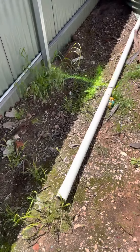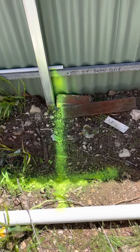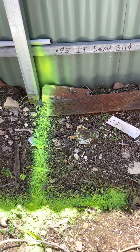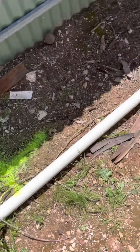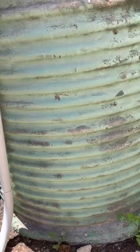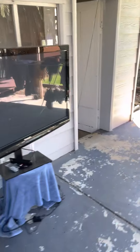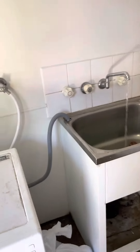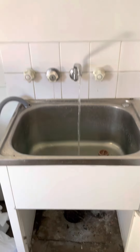Further along the drain we have an unraised sewer IP 100mm, and as you'll see we've marked it about 850mm deep to the bottom of the drain. The drain then continues on and terminates through into this rear laundry, where we've got the sink running and the washing machine which discharges into this other trap — and that's the head of the drain.